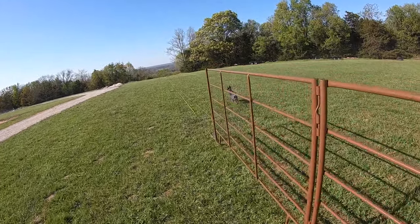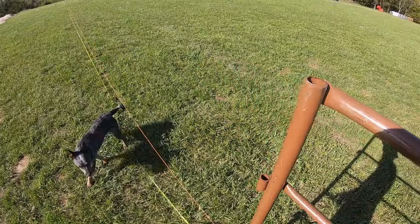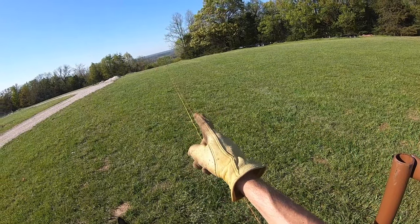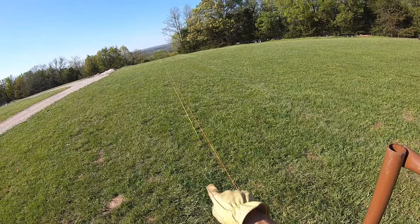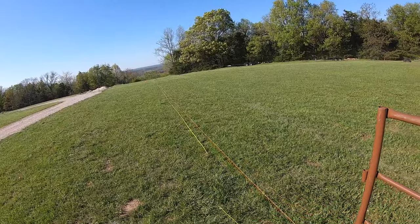What I need to do here is I've put my tape down for 100 feet and my mason line I've strung. And every 10 feet, I'm gonna put a T-post in on this straight line to that corner. So that's what we're doing next.